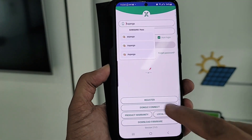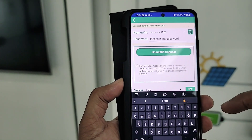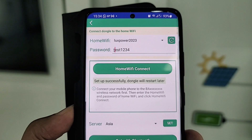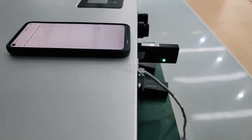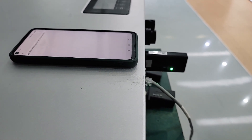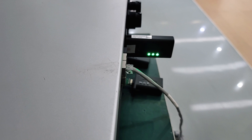Then very quickly, we go to the LuxPower app and click the dongle connect button. Now it shows all of the Wi-Fis that are available in the area. We look for the correct one and put in the password. Once the password is set, we simply click the home Wi-Fi connect button. It is now setting up, and we get a message which says 'set up successfully and dongle will restart'. Now it will go through its startup sequence. You'll see that the configuration of the lights will change as it goes through the various stages. Eventually we wait for all three LEDs to go solid, and that will give us an indication that the pairing to the client's home Wi-Fi has been successful. Here we are with all three LEDs solid, which means the connection to the client's home Wi-Fi is successful.